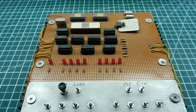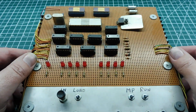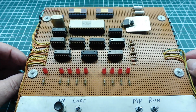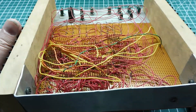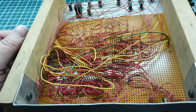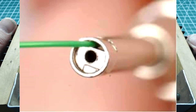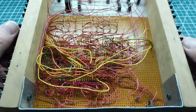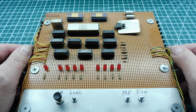Our next prototype technique is wire wrapping. Here's a wire wrap project. You can see the IC sockets on this circuit board have long leads for wire wrapping. If you look at the back, you can see the wire wrap leads on all the sockets, and you use a wire wrapping tool with point-to-point wiring using 30 gauge wire. This worked out very well because you didn't have to do any soldering, and you could get into some very sophisticated large projects using wire wrapping.